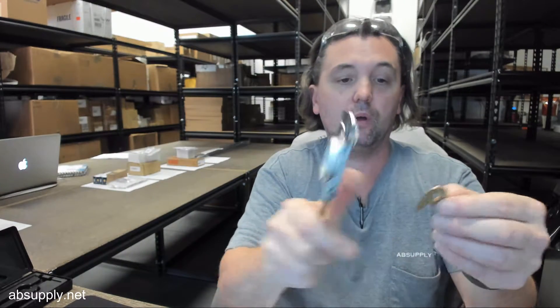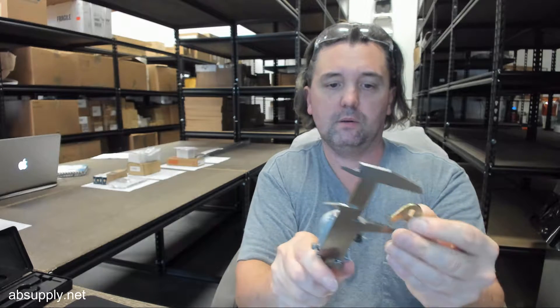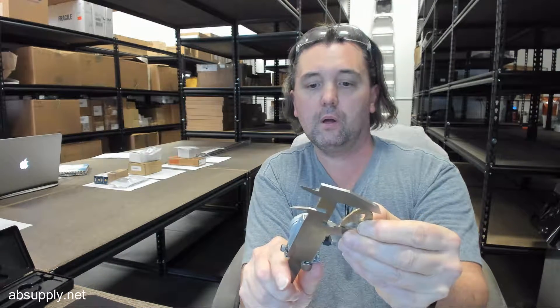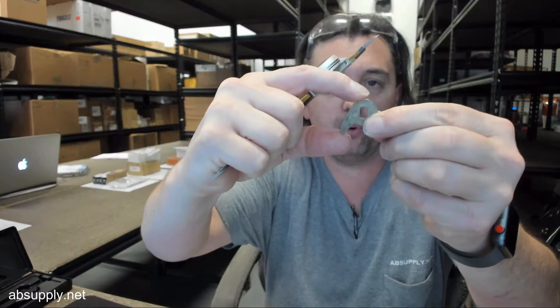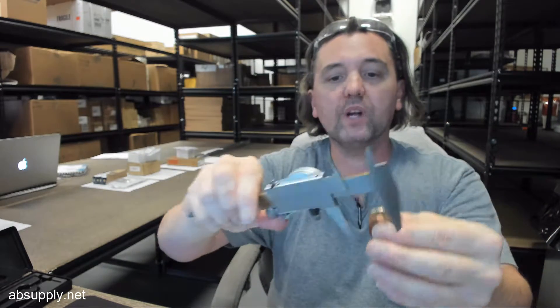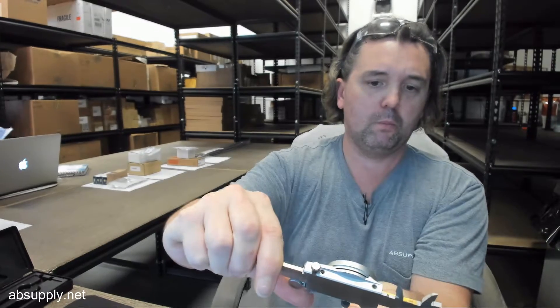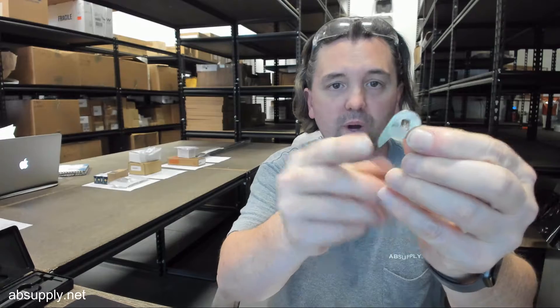Dimensional properties now, let's go over that. Thickness of the cam: .097 — .097 thick. Overall height, when the slot is in the vertical position, is about 1.064 — 1.064 overall height. Overall width in the same orientation: .985 — .985 from this point to this point.